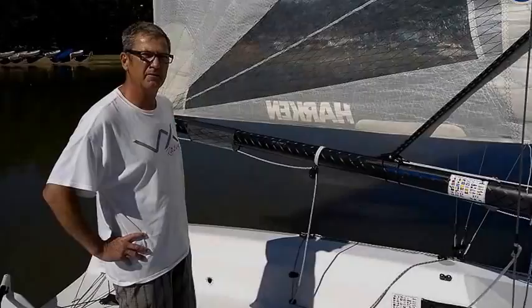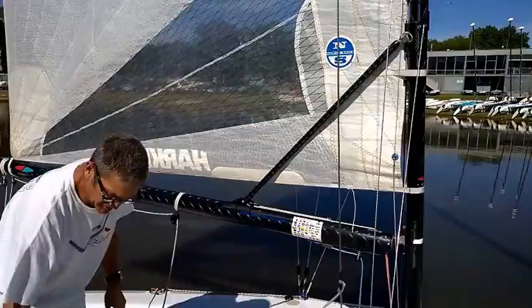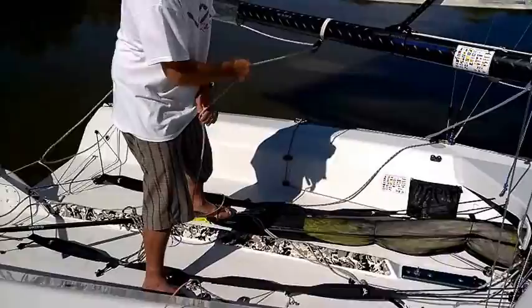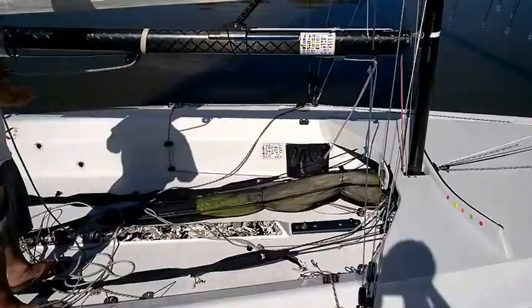Probably my favourite feature of the VX1 is the clean deck line and the room you have — attributed to one major thing: the NAV, which is a vang spelt backwards. The NAV is above the boom and is adjusted at the deck line here by two cleats, so either the crew or the skipper can do it from the edge of the boat from the gunnel. You also have off-the-boom sheeting that goes to a bridle at the back, so there are no travellers. You can sheet through here and play it like a skiff upwind or downwind — very exciting. You can see the keel in position and the final layout.